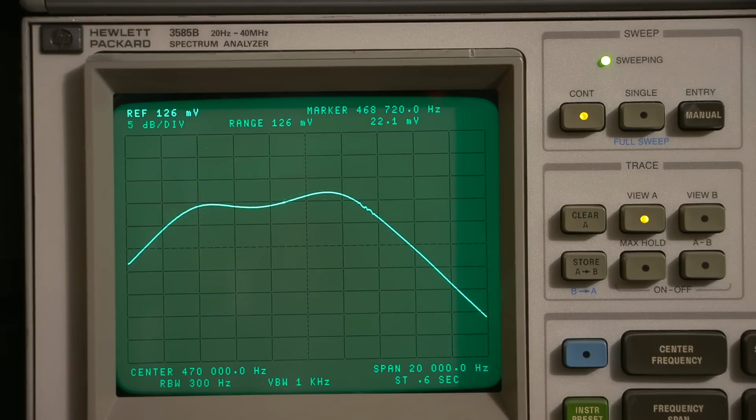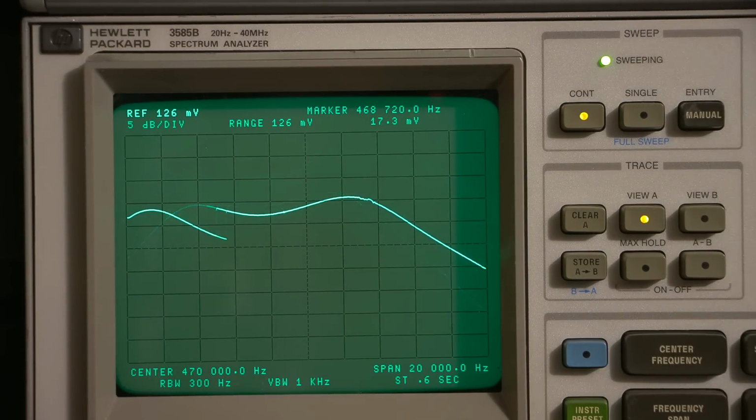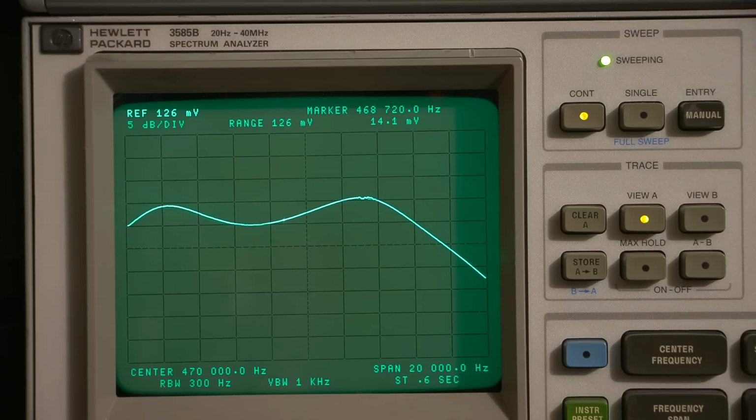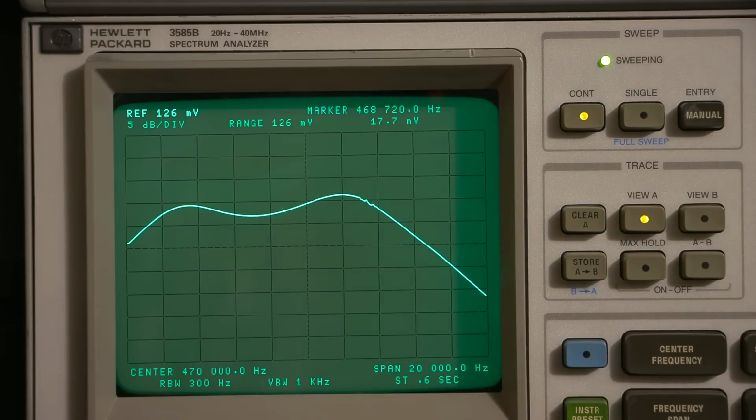You can see it doesn't look too bad there. You can see the double hump right here, right? But that's nowhere near the end of the fidelity control. That's the end of the fidelity control, okay? So you can see that it's starting to look a little bit more like it should, and that's just by tuning those two capacitors. So you get the stage curtain effect, the double hump happening here. So again, I'll get all of this done, and I'll show you exactly how this should look, and then we'll be on to the RF and oscillator and antenna section tuning as well.